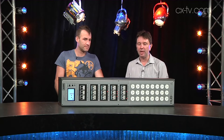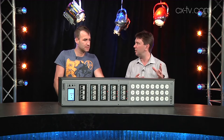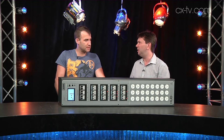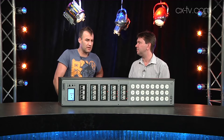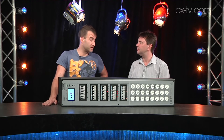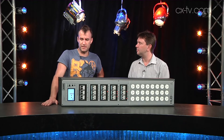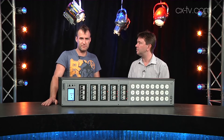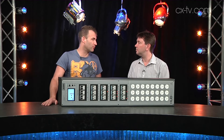It's all about making it easy to integrate the more building side of the infrastructure into the more theatrical side — smoke machines, LED and tungsten fixtures. For anyone who has still got a decent inventory of conventional stuff but is moving towards solid-state lighting sources, this is good because it gives you the option to instantly change from a dimmer into either a hot power or a DMX remotable panel.